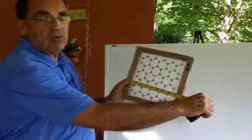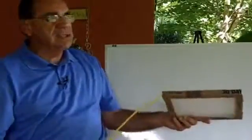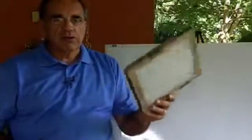They take out 1/4 of an inch. Now, I don't know why they do that. On some of them, it actually says actual size, but in this one it doesn't. It just says 10 by 10, and it's not really 10 by 10. So make sure that you don't go by just this. Make sure that you actually measure.